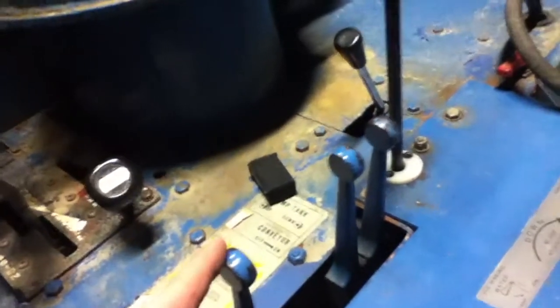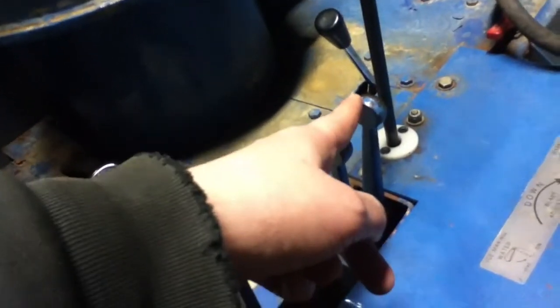You have a series of handles. This is for a vertical auger. This is for the horizontal auger. Auger down there in that deck. Auger right here in that area. This is to raise your conditioner up and down. And then you have this lever over here to dump when you're done. And we'll just show you that real quick.